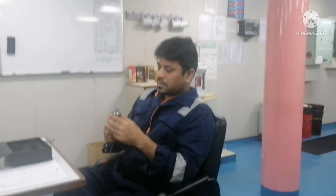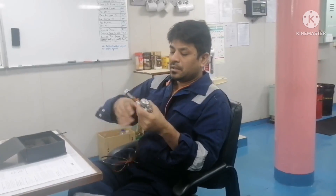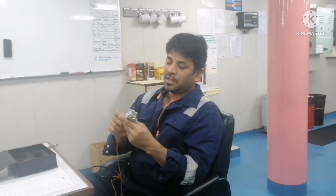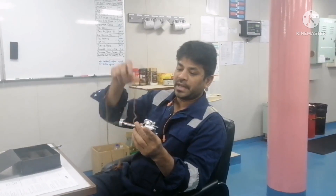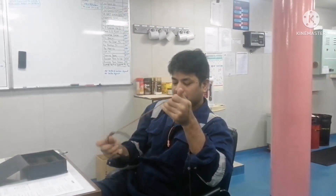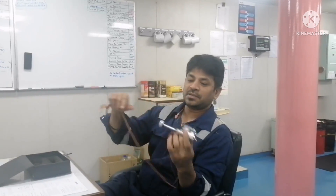For taking the crankshaft deflection, we use a crankshaft measuring tool — the deflection gauge. The deflection gauge will be tied with a rope. The reason we tie the gauge with rope is that sometimes when we fix it in the web, it tends to fall down. If it falls down, you cannot easily put your hand in to remove the deflection gauge. So if you have this kind of arrangement, even if it falls down, it will be in your hand and you can easily pick it up. This is why we tie the crankshaft deflection gauge with a rope.